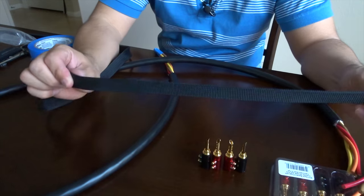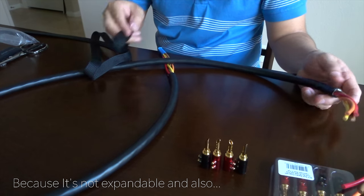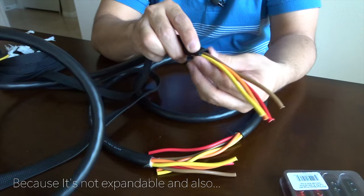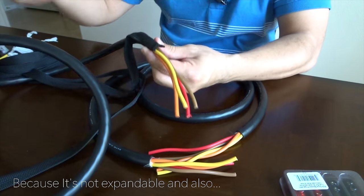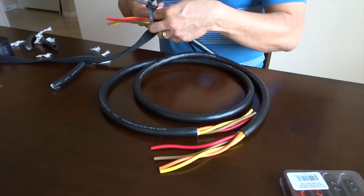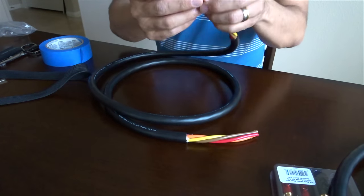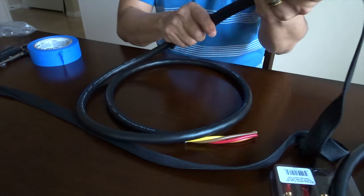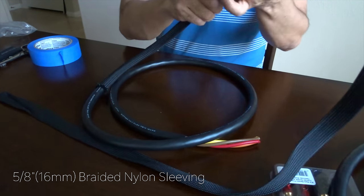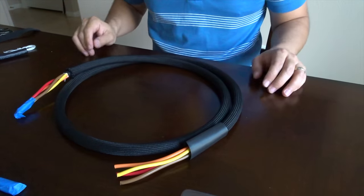Here's a little tip: when you're using this kind of nylon high quality braiding, you need to cut it longer than the actual wire you're going to put inside, overlapping the outer jacket, because it will make it easier for the heat shrink to grip tightly. I'm going to cut it, then put the wire inside the braiding. To do that, I'll use painter's tape to loom the wires together. Even with the 5/8 inch braiding, it's not a loose fitting — actually it's a perfect fitting, I would say. The jacket is already on; this is how it looks.